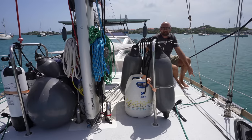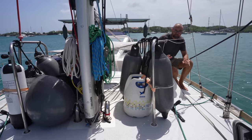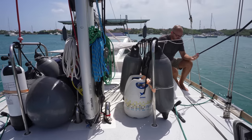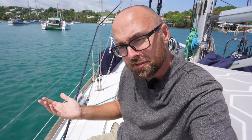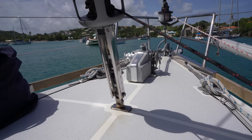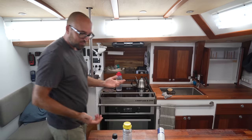This chain plate right here is leaking and it's starting to get personal. We have six other chain plates that are not currently nor have they ever leaked, yet it's my third go at getting this one to be leak free. There's a quote that goes something along the lines of: the definition of insanity is repeating the same action over and over again and expecting a different outcome. So in the interest of not coming across as insane, I think it's time we change tactics. Almost all of the deck hardware aboard Athena is bedded using butyl tape, including all of the other chain plates which haven't leaked. But I think it's time to try Sikaflex on my stubborn friend.